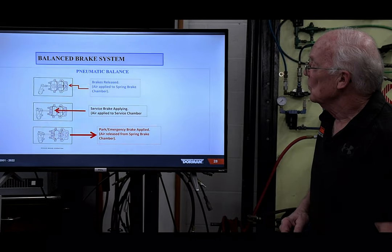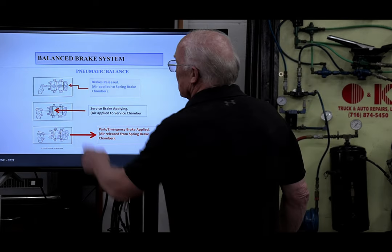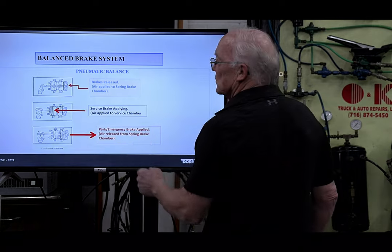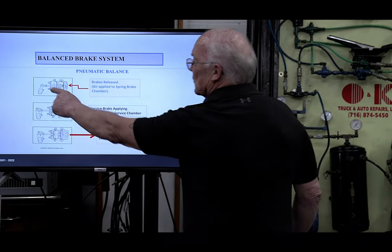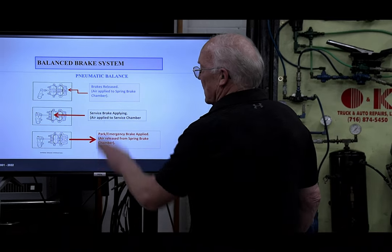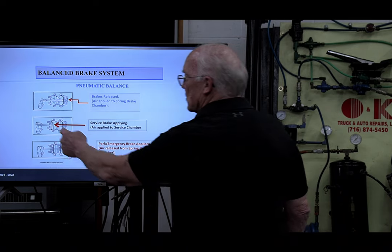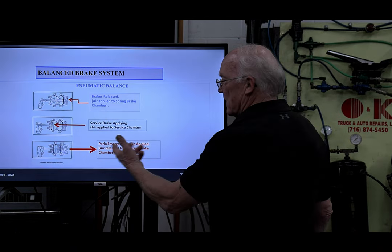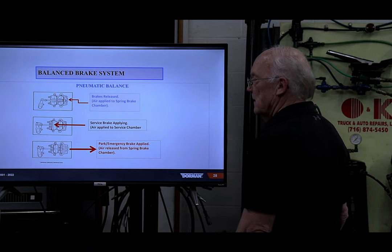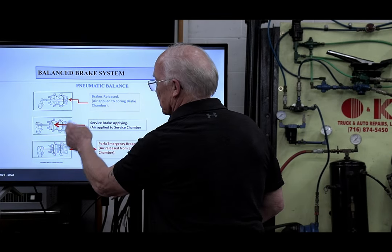Slide everything I walked through over here. Keeping it stupid and simple, in case you didn't get it, I have now put air in that fitting that's closest to the back, farthest away from the push rod. I push my yellow button in, brakes are released. Every time I step on the brake, now I'm able to use that front portion. If I got a park, out it comes. It's that simple. That coil spring will come out and you can see the differences over here.